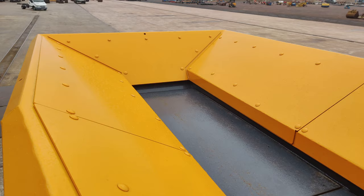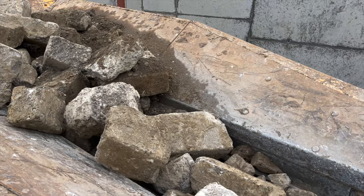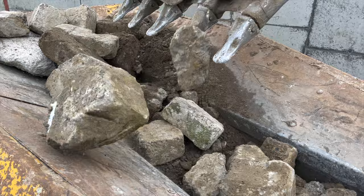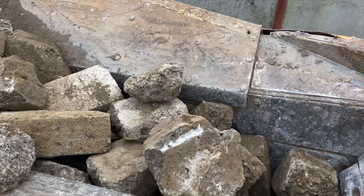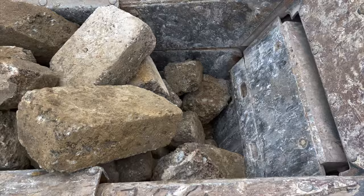Moving up towards the loading area, we've got a few nice features to keep the flow of material into the jaws consistent and the machine working at maximum efficiency. A lot of people tend to want to load straight onto the jaws, but this actually slows down how much material the machine can crush. If you want to keep the machine working quickly, you need a nice consistent flow. To get that, this Barford 750J has a vibrating feeder that pushes the material along at a consistent speed. It also has a feed sensor to control that flow if it's getting too quick for the machine, providing a nice consistent flow which makes the machine crush really well.